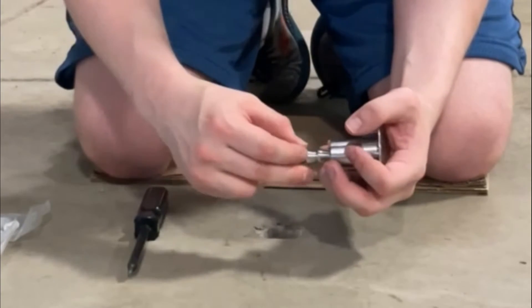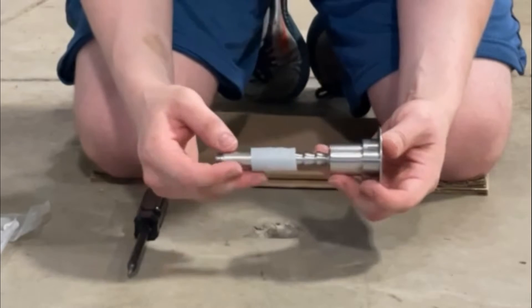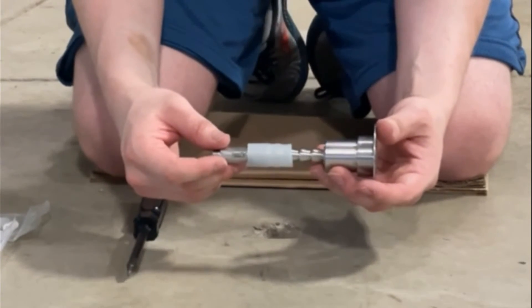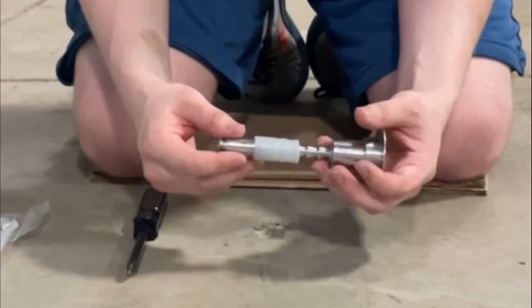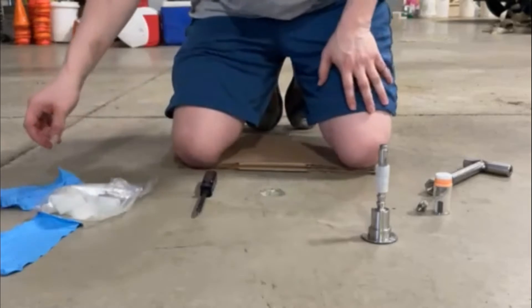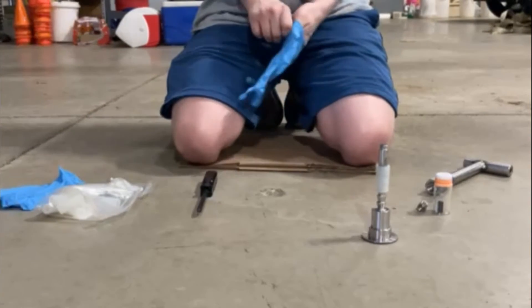We are lowering the sleeve down a little further than the normal two-and-a-half barbs because the bodyweight installation method tends to require more room for slippage of the sleeve along the VaporPen device as it is inserted into the slab. Now that the sleeve is in place, prior to touching the Waterloo Passive sampler and inserting it into the capsule, I'll be putting on some gloves.